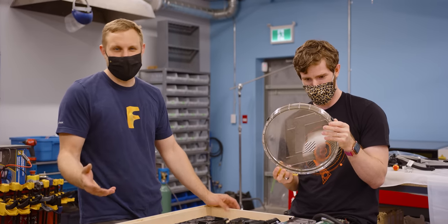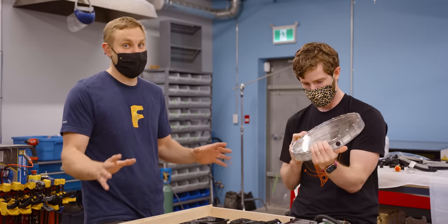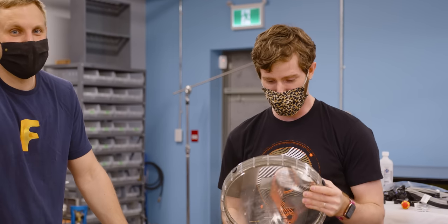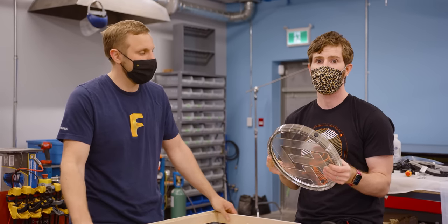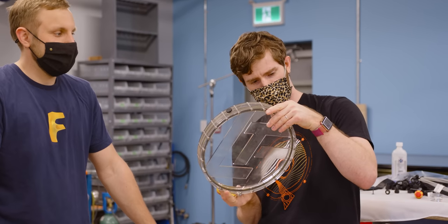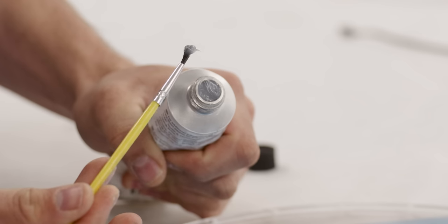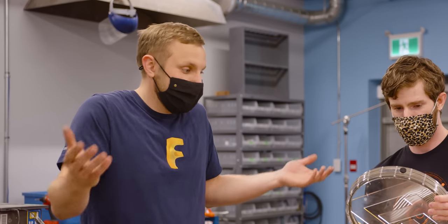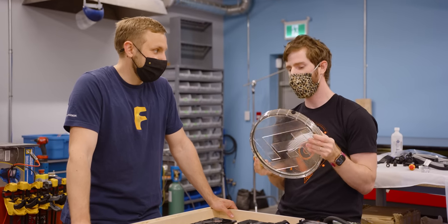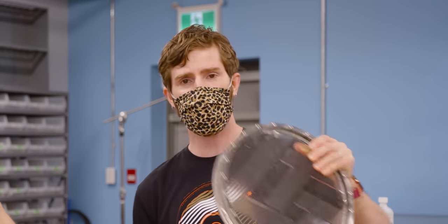Moving to a four-piece design makes o-ring sealing way more difficult. I thought I could maybe get away with acrylic solvent welding the whole thing together, but it's a one-shot deal - mom's spaghetti. The small test chips look great, but the bigger test chips leave a lot to be desired. That means we're back to using o-rings from cord stock. We have to make sure to tighten them evenly so they can press equally the whole way around. The yellow ooze - yeah, that's o-ring lube, it's like Vaseline essentially. I needed every chance I could get to keep it sealed because the laser leaves it a little bit rough in the grooves. It yellowed a bit with water, but who knows - maybe some water changes will help fix that.